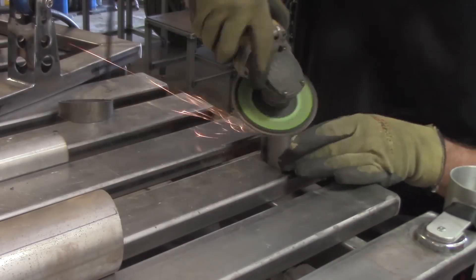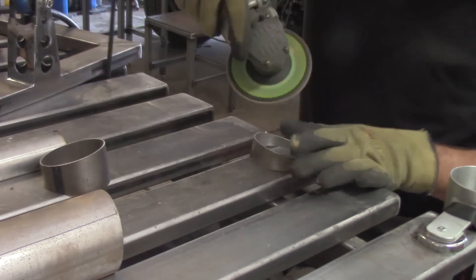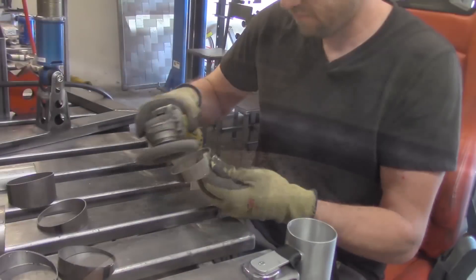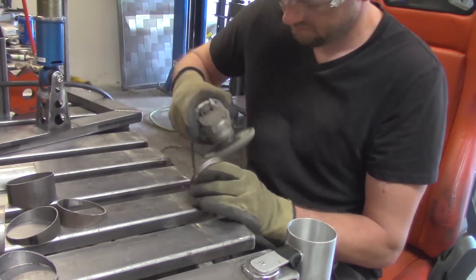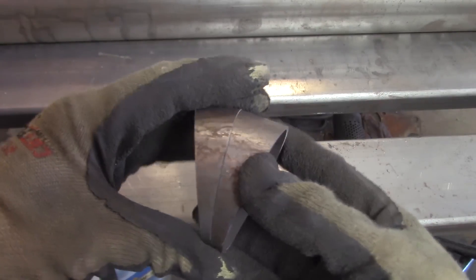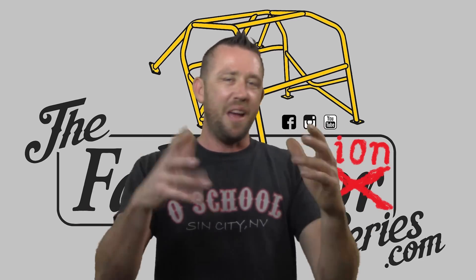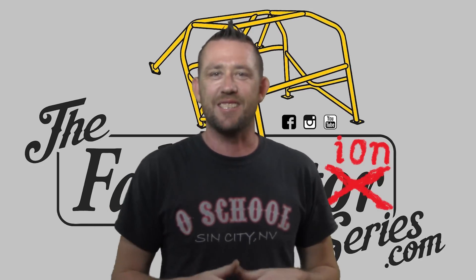I'm going to combine this with all the cleanup efforts. Grinding to clean these up — very, very light work. Just let it take the burrs away. Don't gouge into it, don't push into it. Let the flap disc do the work, not your muscles. If you have any large gaps or any significant changes, you're not going to get a good, clean fit up. And a good, clean fit up like this is exactly what we want on our pie cuts. So, very light work. Now, if that was all the information you needed about pie cuts, thank you for watching. I'll see you guys on the next episode.